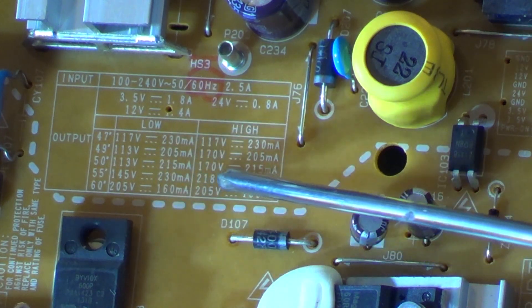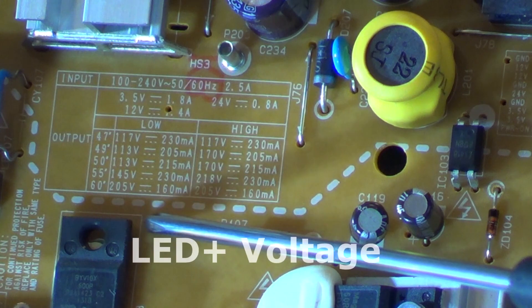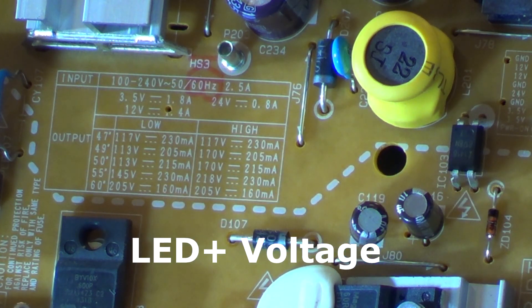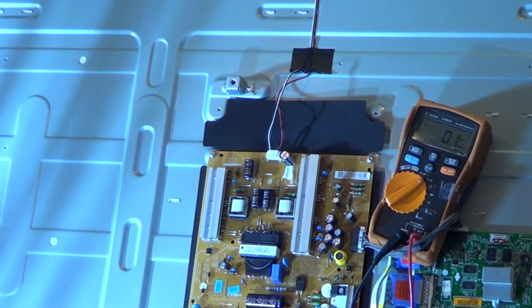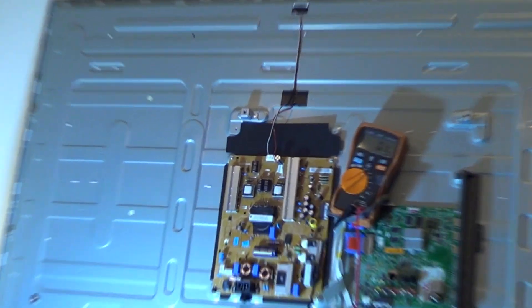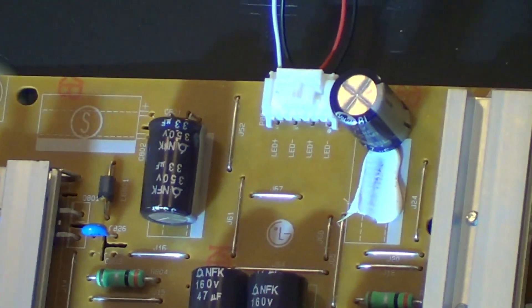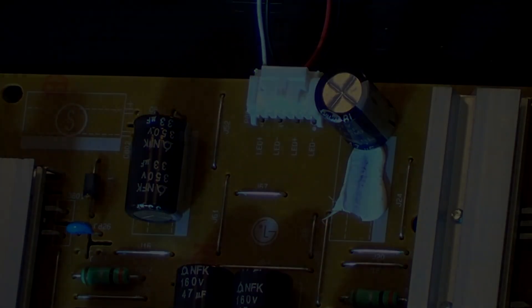As you can see, on the bottom there is our LED+ voltage. There are two lines, three strips on each line. They should each be reading 205 volts — that is the LED+ voltage. That'll be the first thing we'll check. I've already checked the actual LEDs and they are reading good, so we're mainly concerned with the LED+, not the minus. The minus is the feedback or return voltage.